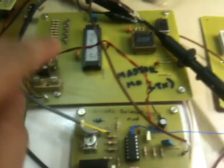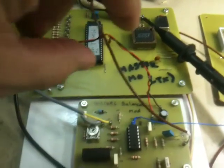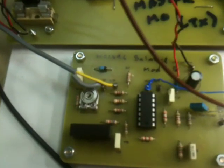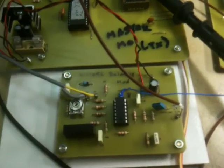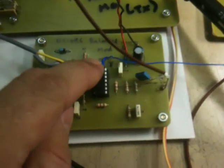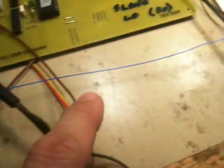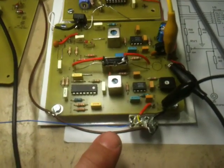The transmitter outputs from the direct digital synthesizer. The master oscillator effectively is on this brown cable. It feeds into a balanced mixer, an MC1496, and we've got it set so we've slightly off-balanced the mixer to generate a double sideband AM signal. The double sideband signal, which is stepping in frequency, is loosely coupled to the input of the balanced mixer on the receiver front end.